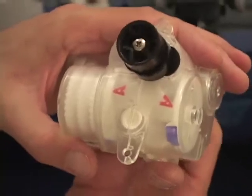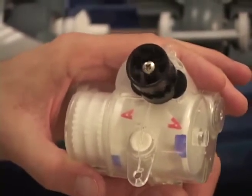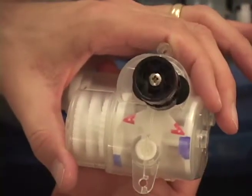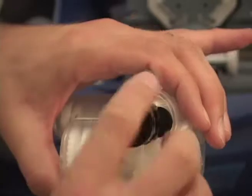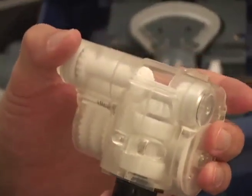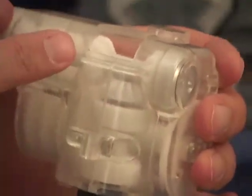So again, as the cleaner cams move around to the pivots, you'll see the black pulley switch from going counterclockwise over to clockwise. This spot right here is where the pulley stops. This is our neutral position. Nothing is happening when I turn the pulley. If I turn to the top, you can see why. As the pulley is in the neutral position, it's able to shift between this miter gear and this miter gear. That's what changes the direction.